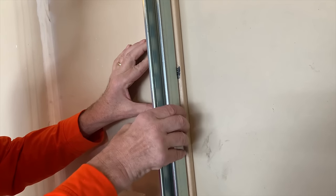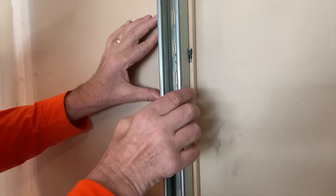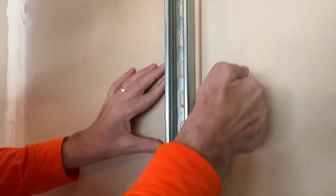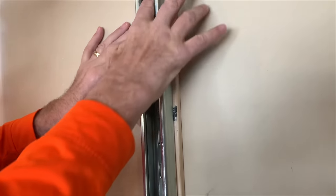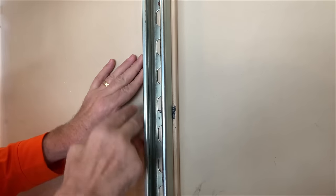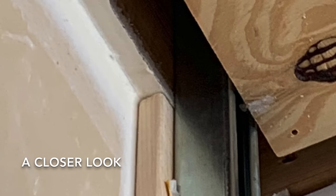The first thing we had to do was get rails and attach them. Some people who do this use the garage door rails, which is fine, but I thought this looked cleaner, so I went with these. These are super strut, one and five-eighths inch channel — very sturdy. I'm screwing into the studs behind the drywall with three and a half inch screws. These don't have a lot of weight pulling on top of them or out on them; they just have to guide the carriage going up. I did have to consider what happens up on top — the joist sticks out a little bit, so I had to put in a furring strip behind it to make it line up perfectly with that joist on top.